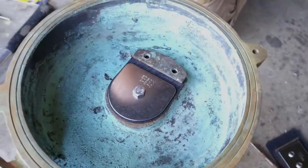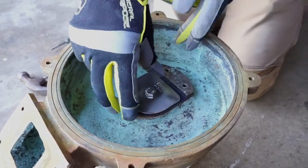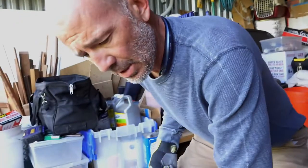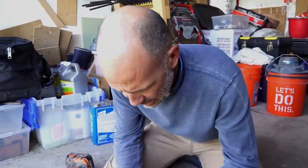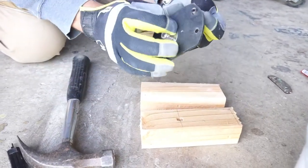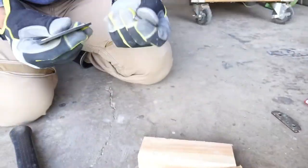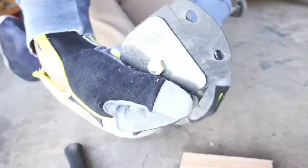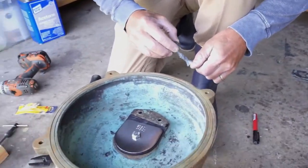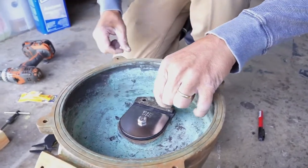We're going to use the old bronze piece because the holes fit, but the gasket holes don't line up. If I had tapped holes in a different location, it probably wouldn't have worked as easily. Anti-seize applied to the new holes — just a little to keep this thing from welding itself to the bronze. Try not to strip them out.